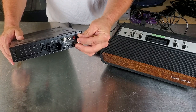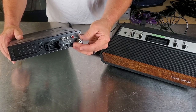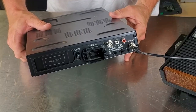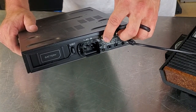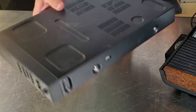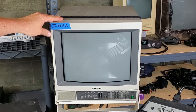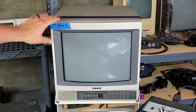Let's get ready to test this device. First, I'm going to put a coaxial adapter on here, which will allow me to connect the Atari's RF cable to this device. Now we have that connected, and we can run our audio and a BNC cable from this into the professional video monitor. Today we're going to use the Sony PVM 1343MD and hook up the composite video input on it.